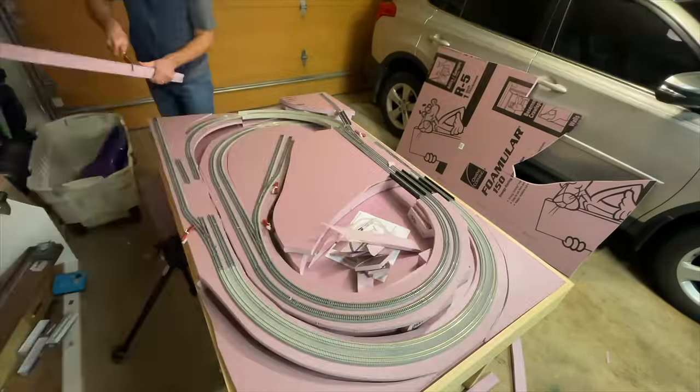Once the wires were all in place, I used a pair of wire strippers to cut off some of the excess wire and to strip all the ends of the wires. I then ran a pair of heavier gauge wires down from the Digitrax base station to the underside of the layout to serve as the bus wires. I connected all the blue power lead wires from the track to the blue bus wire, and all the white wires to the green wire. I would have used a white wire here, but I just did not have a heavier gauge white wire.